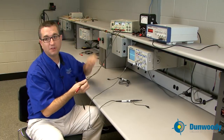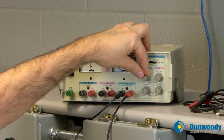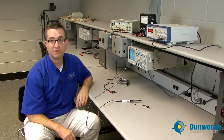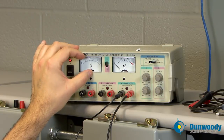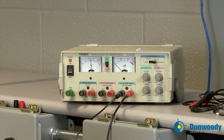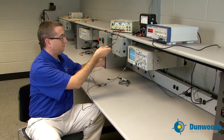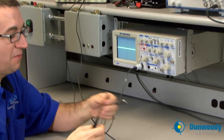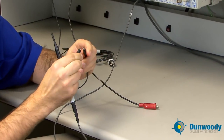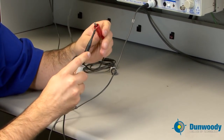I have a DC power supply over here, and I'm going to set it to some voltage — I'm guessing about 12 and a half volts. We'll find out how accurate the supply's meter is when we put it on the oscilloscope. My positive lead is going to hook up to the probe and my negative lead to the reference. I'll hook my reference lead up to the negative and take my probe to the positive — that'll be my actual signal.